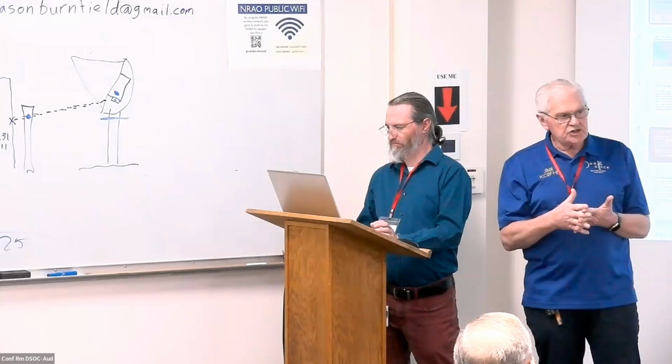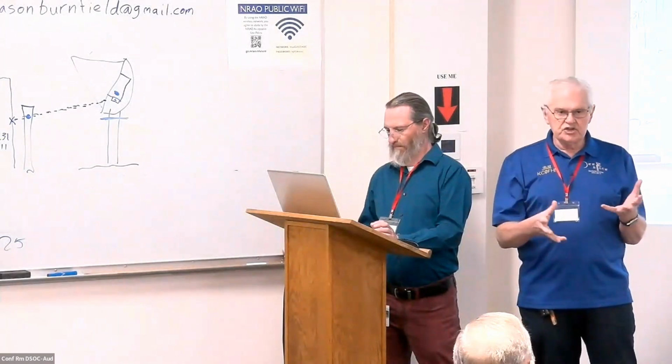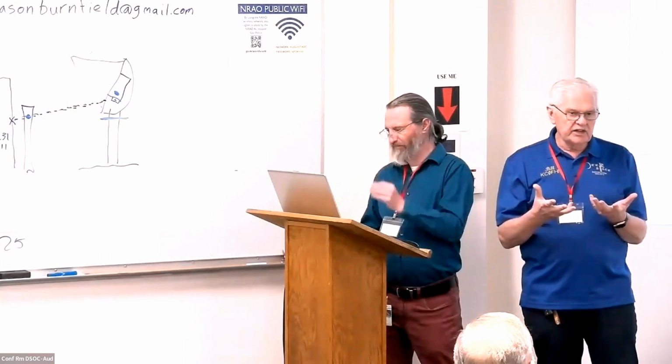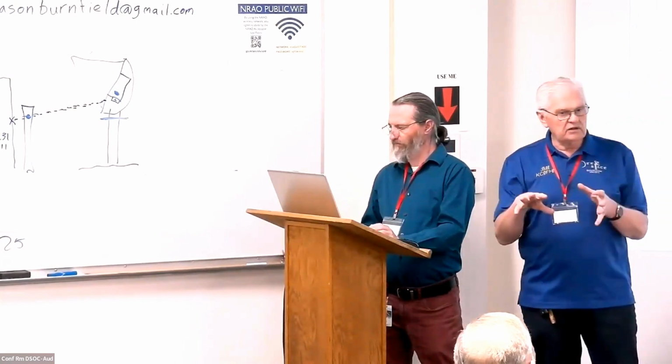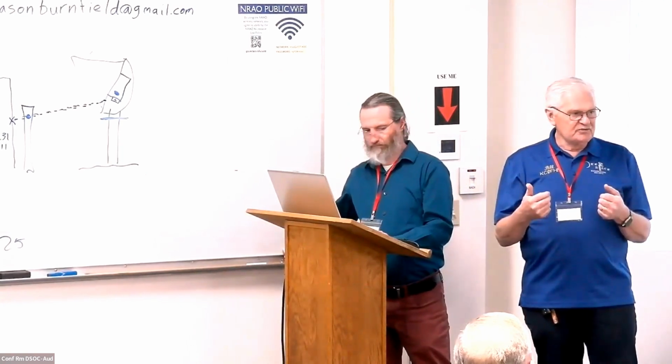Most EME communication is done with digital modes because people have small dishes and small transmitters. And so with the digital communication mode, you can be below the noise floor, in fact, and still send a signal and send your call sign and your location and all that. So now we have the capability to do a little more than digital communication. We can do single sideband. And we're one of the strongest stations out there doing single sideband.